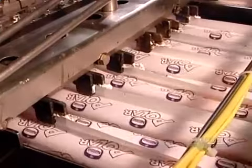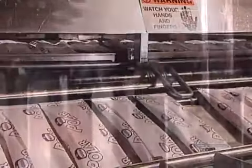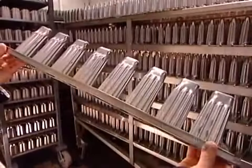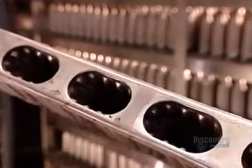The machine deposits the cream pops into a continuous stream of paper wrapping. Heating elements seal the wrapper on top and between pops. Then a slicer cuts them apart. The empty molds go through an automatic wash and rinse cycle on their way back to the start of the line. These molds are for making chocolate fudge bars.